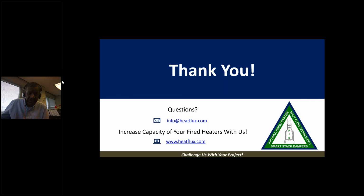Can CO emissions occur if the radiant section is too large? Normally, CO emissions do not occur if the radiant section is too large. CO emissions occur if you have bad combustion, or if your flame temperature or firebox temperature goes down very, very low.